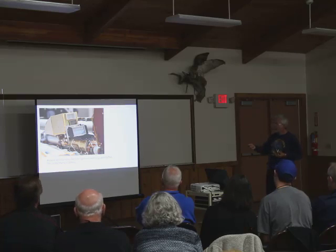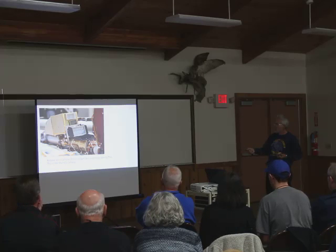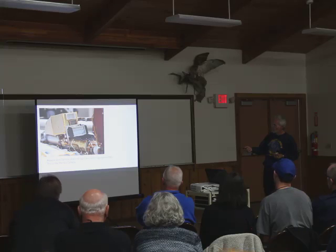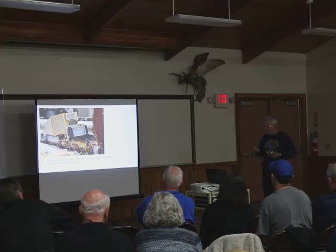So this is the robotic arm camera. This is the Mars 01 camera with the new LED lamps. There's all the little LEDs in there. What you can't see is there's a portion of the lamp housing that shines light down, because when you're looking at the tip of the scoop, it's half an inch away from the front of this window. So these lamps here aren't going to light it up, and these here aren't either, because the scoop is up here. So they go below the scoop, and these are shining in the back of the scoop. So we had to have another set of lamps that shone down to get that front of the tip illuminated.